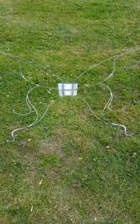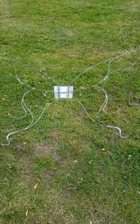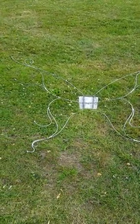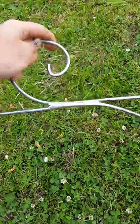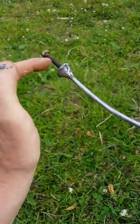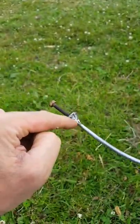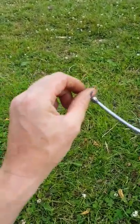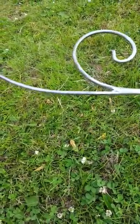I thought I'd do a quick explanation video on how we just made Clary's new fire wings. We used five mil or six mil bendable bar rod — it's bendable without heat, hence why we did that. We put a nut, washer, and bolt system up on the top here — it's just a bolt with a washer welded onto the bar, kind of ground off to make it a bit fluted.